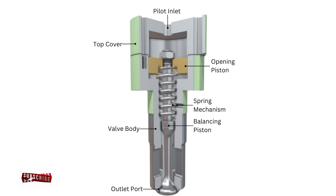Step four, timing: the air valve opens only near TDC — top dead center — when the cylinder is ready for starting air. This timing is controlled mechanically or electronically. Step five, valve closes automatically: when the pilot air signal stops, the spring pushes the valve spindle back up, the main air passage closes, and the valve is sealed. Step six, safety feature — drain hole: if the valve leaks, the drain hole allows air to escape visibly, helping identify leaky or stuck valves before they cause starting issues.